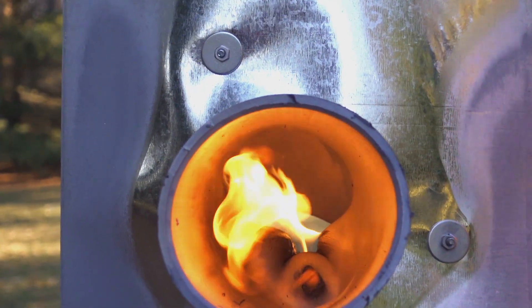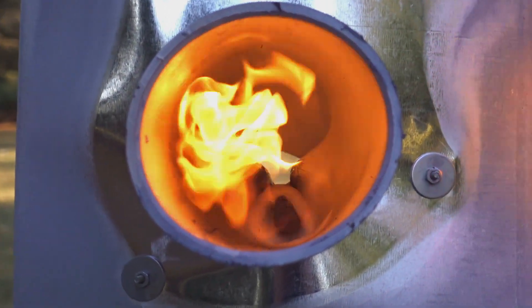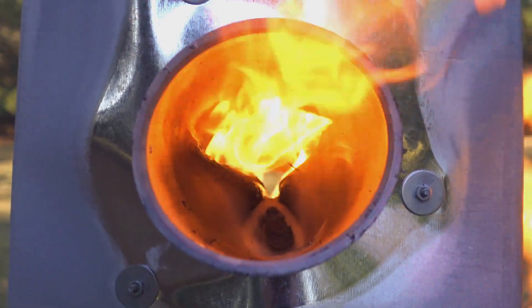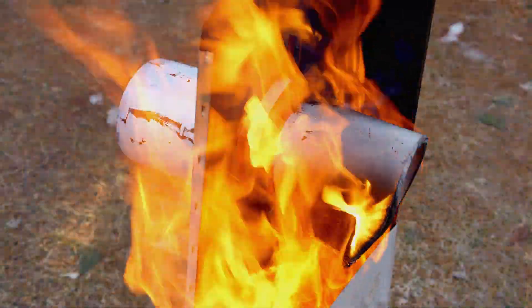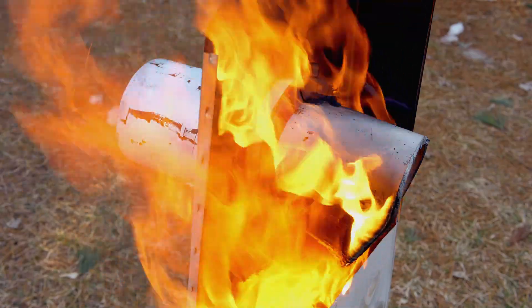There is a lot of flame coming through, but again that's my fault for using the short pipe. In real-world use a pipe like this would be filled with cables and wires, and already the amount of expansion would probably be enough to seal around them. In addition, by using the polyethylene pipe instead of common PVC, the pipe itself is less fire resistant.